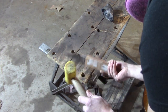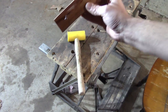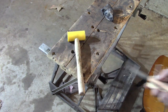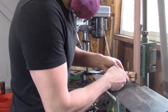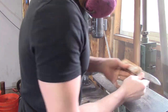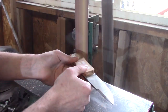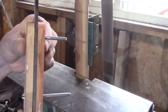You get a lot more done on the grinder before you epoxy. I've had a couple times where I didn't do any work beforehand, and when it's epoxied I'm just heating it up too much — heating up the epoxy. I've actually had pieces of the handle shoot off. This is just a lot safer to do the grinder work first.